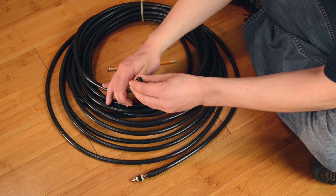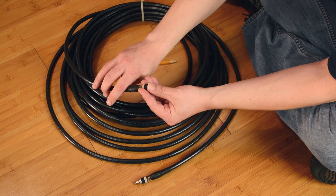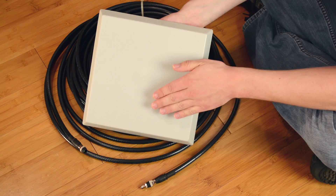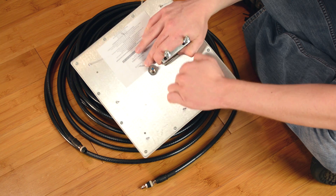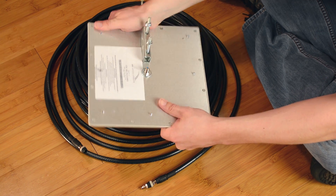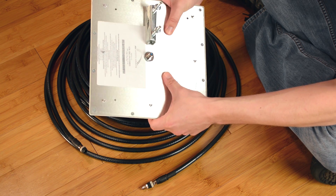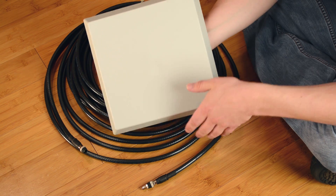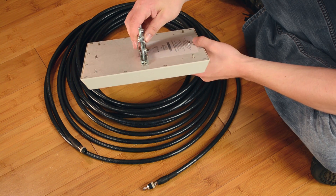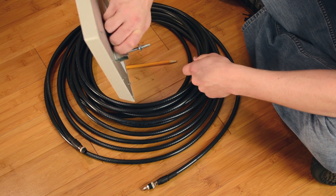These don't look like your typical F-type connectors. An F-type connector is what you find on a normal cable television connection; this is the same, except it has a boot on it, which is just to keep rain and water out. Now, on the other end of things, we have the antenna. This is a flat antenna, obviously — plastic on the front, aluminum plate on the back. It's actually fairly rugged; if I try to twist it, it won't twist or bend at all. Seems pretty well made with a fairly thick gauge of aluminum on the back. It looks quite discreet, so if you're mounting this outdoors your neighbors probably won't be complaining about the eyesore. It's also got a fairly heavy gauge steel pole mount — a clamp that clamps down the pole — tighten down these nuts and you're good to go. It allows you to pivot the antenna when loosened so you can aim it at the cell site.